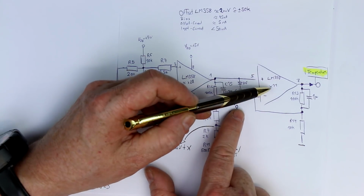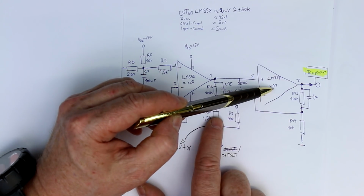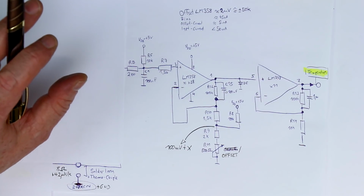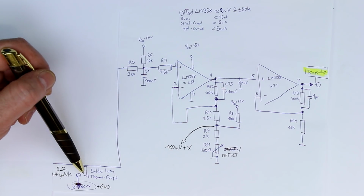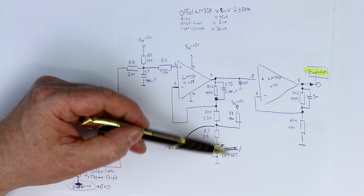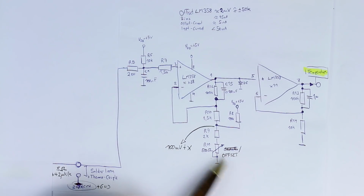And well, the second op-amp is just clear. It's another non-inverting op-amp with a fixed gain of 11 with the 100K and the 10K resistor divider. So that is all to say. Although the circuitry of course has 2 big problems: no cold junction compensation, or they do it in software with a constant offset, just add it in software. And the second is this combined scale plus offset trim pot, with which you simply cannot fully null out both factors. So how could we improve here?